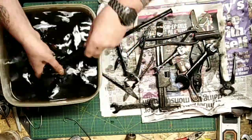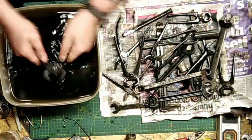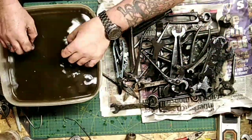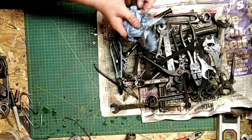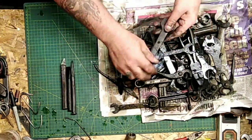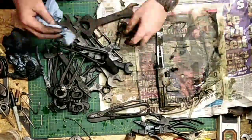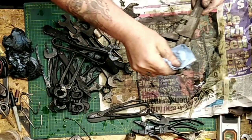The only difference I'm finding is there's a white sludge when you get near the bottom, and the sludge is getting thicker and thicker as more tools go through it, but it wipes off the same as everything else — it's still working fine. All that's required when it comes out of the Deox C is just to give it a wipe dry. I don't rinse it with water or anything; that doesn't say that in the instructions. The harder-to-dry things I just clean up last, wipe them, and let them dry naturally.